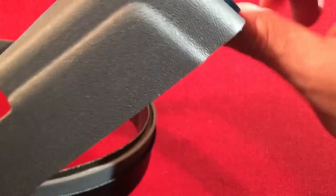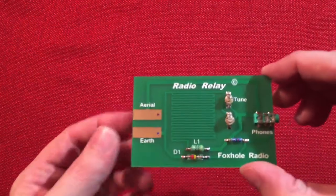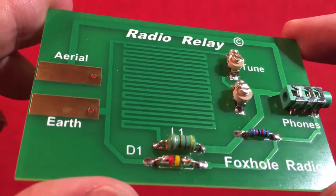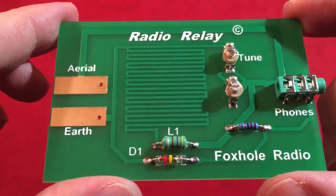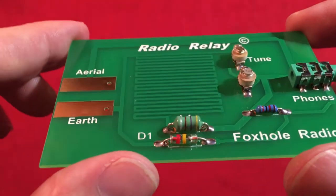I use this — it's really handy. Flips down. You get a good view of what you're doing, stereoscopic. So handy to have the headset. As you can see, I also like to clean the board up. When you use that paste it tends to run a bit and kind of discolor the board. So I cleaned it up with some 91% isopropyl alcohol with some Q-tips and cleaned up most of the flux there.